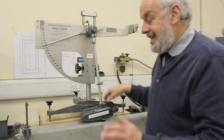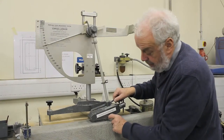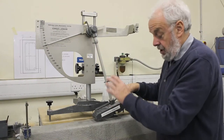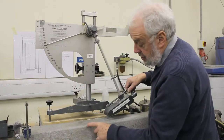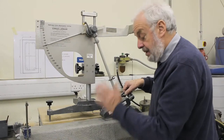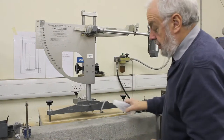In order to test consistently every time, there are many standardized parameters. This is a particular type of rubber slider of a particular width and length. The mass of the arm has to meet a certain tolerance, and the distance travelled has to be the same. All of those are specified, and to ensure repeatable conditions, the test is repeated wet through every time.